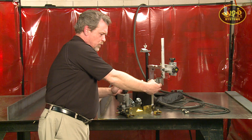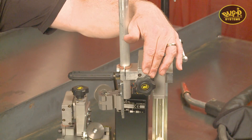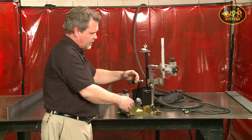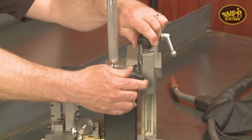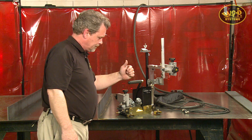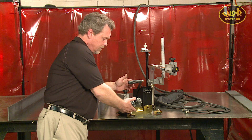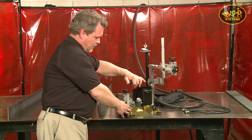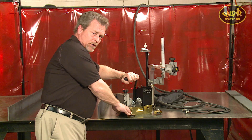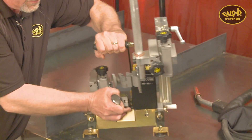Also on this side, we have the outboard torch holder, fully adjustable vertically and horizontally, and again with micro-slides so that once the rough adjustment into the corner is set, you can fine-tune the position of the gun before and during welding. The work side also includes a spatter guard to protect the wheels, and the handle serves not only for carrying but also as a magnet release that releases a majority of the holding power so that the machine is a little bit easier to transport between jobs.